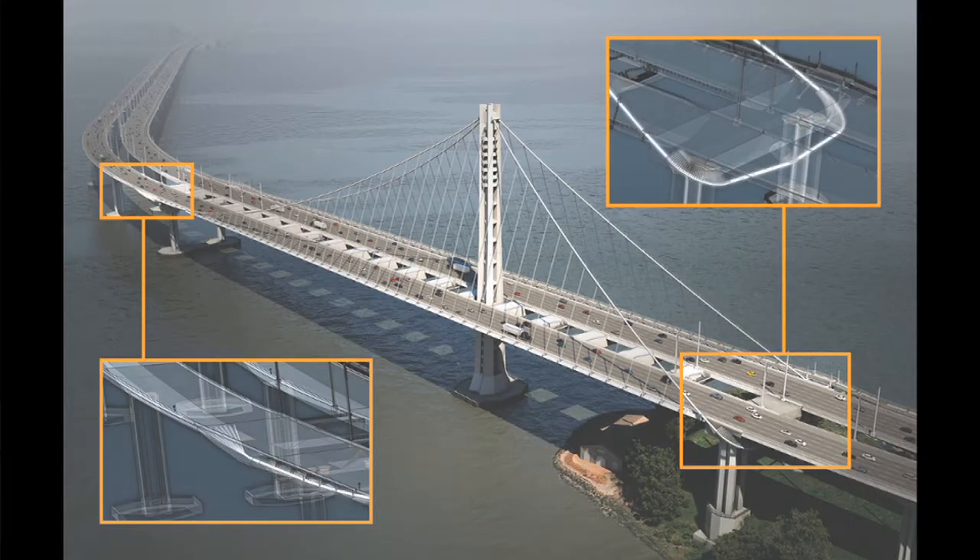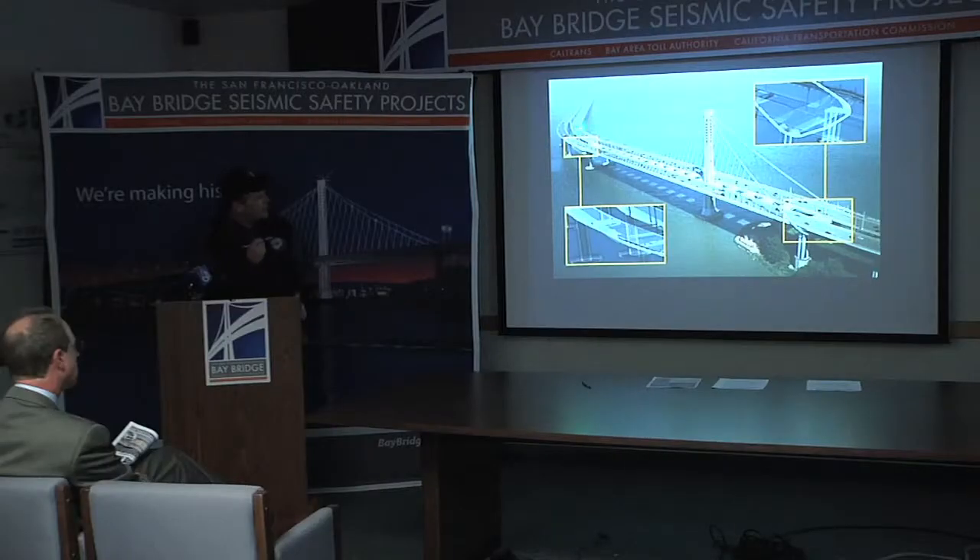Some of the key areas for our bridge on the east and the west: the splay chamber right here. This is where our cable comes back and ties inside the deck. It fans out, and each one of those strands — there are 137 strands in the main cable. Each one of those strands has 127 five-millimeter diameter wires. They're all locking back into a very sleek anchor point right here. The other unique thing about this bridge is that it wraps around the back end here, and we have a jacking saddle which places tension on it after load transfer.